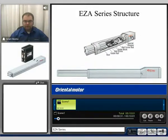The closed loop stepping motor is located towards the back section of the actuator. It's coupled to a ball screw, which is in a fixed position. As the ball screw rotates, it interacts with the ball nut, which is attached to the linear guide. With rotation, it forces the ball nut forward and backward along the linear guide, creating linear motion.